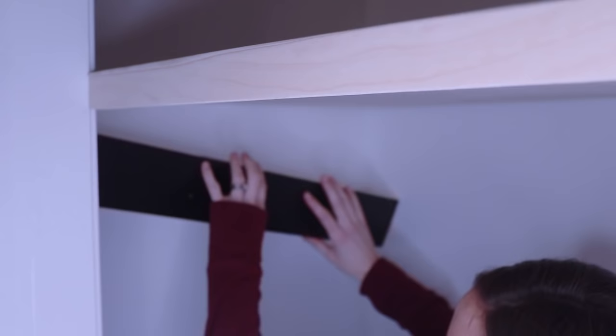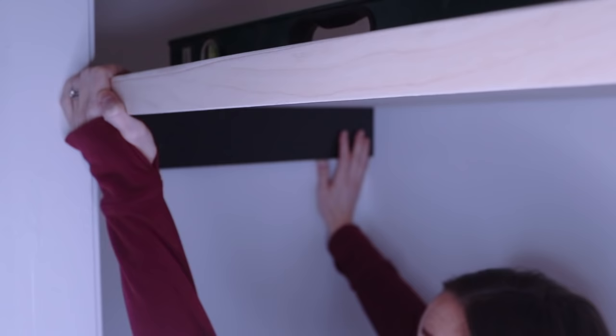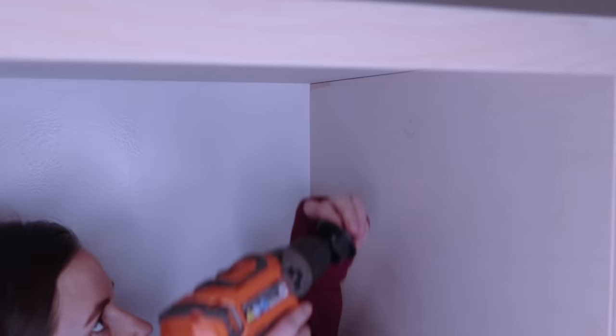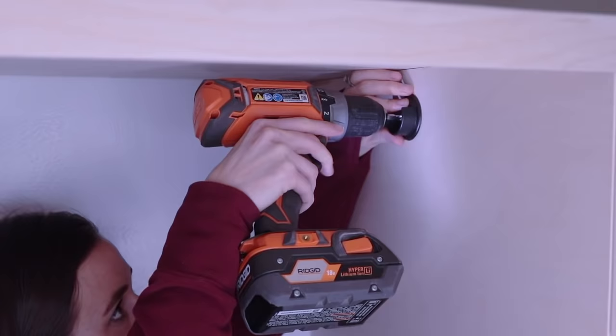I did a second clothing rod along the bottom underneath the middle shelf in a similar manner. I cut a 1x4 and painted it black, then drilled it into the wall studs as a support for the edge of the shelf. My husband is checking the level with the four-foot level that my shelf in the closet is perfect before I screw in the support piece. Then on the support piece I have a little closet rod hanger — this is plastic that I painted black — that I put on the 1x4, and then on the other side I screwed it right into the drawer box so that I could put in a PVC rod.